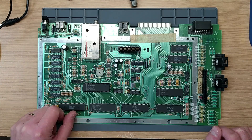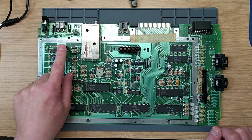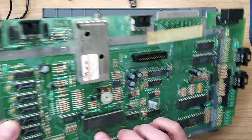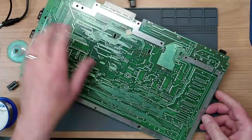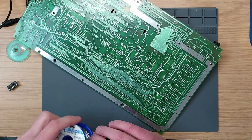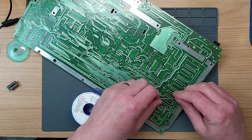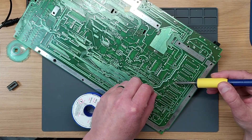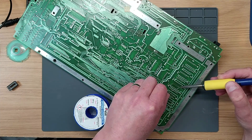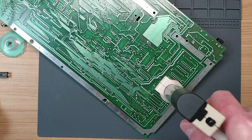To begin with, we'll just stick a socket under this bad DRAM and replace these two caps and see what that leaves us with. We'll add some solder under this dodgy DRAM to get it taken off, then whack a socket in. It should be the fourth one from the front - one, two, three, four - so it's that one. Added a little bit of 60/40 on here.